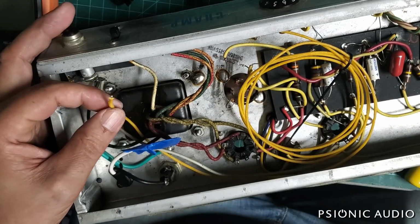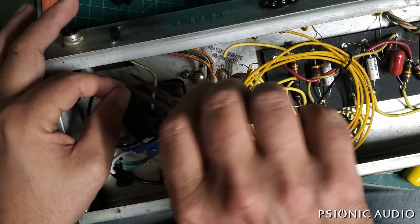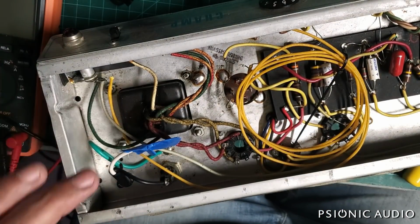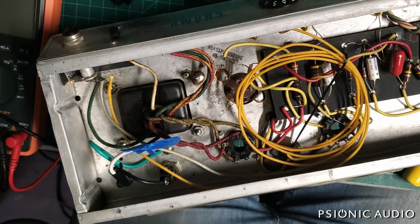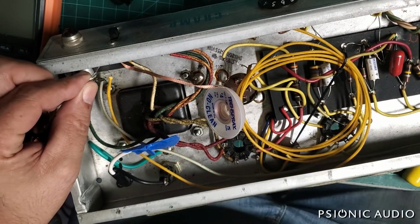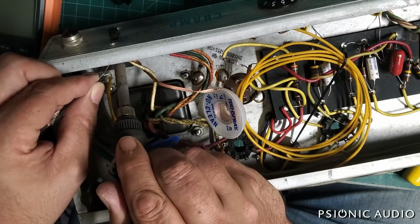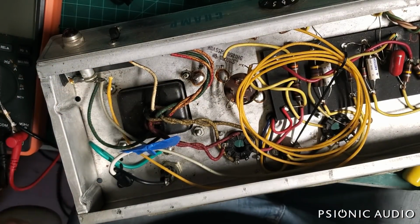But two things. First of all, this is just a Champ with very little current. Three things. Champ, very little current is number one. Number two is a very short distance. What do you think of this? 5 inches. The current capability of any given diameter wire, the wire diameter, the gauge, is one factor. The other is the length. So if this were a 10-foot connection for this amount of current, I would probably need 18 gauge. For 4 inches of this amount of current, a 22 is just fine.